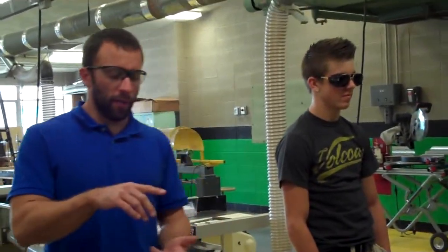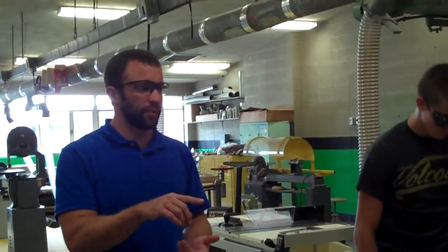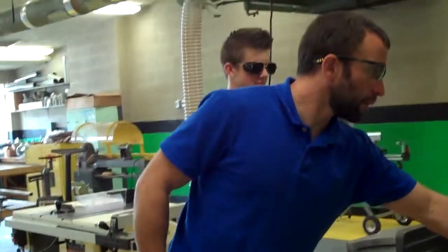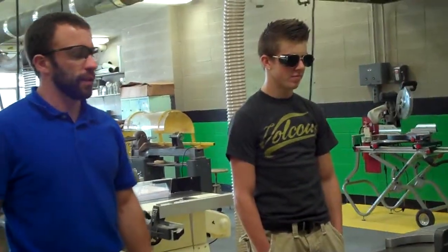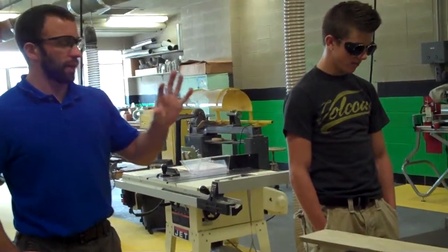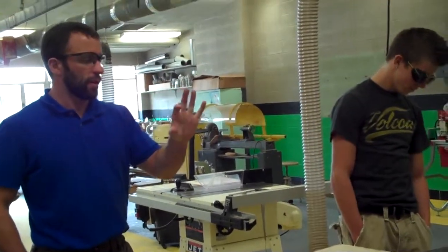All right, our width of board we want to make sure is at least 2 inches wide. Okay, so a 2-inch wide board. Construct hold-down push blocks in order to send a board through this. Now, if we're right around that 2-inch width for our board, it's actually not safe, because what is our safety margin going to be, Luke?